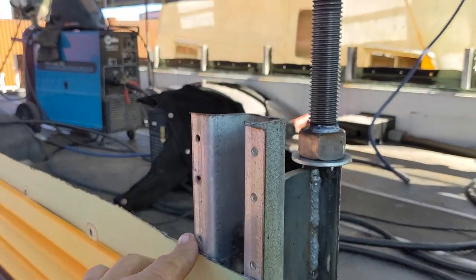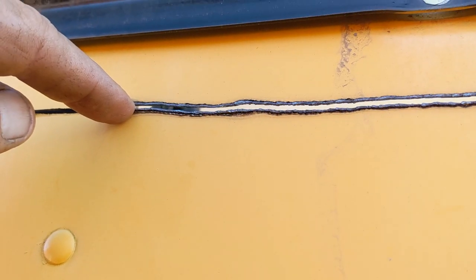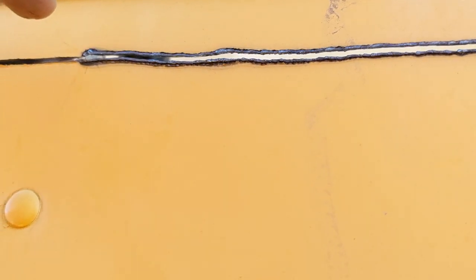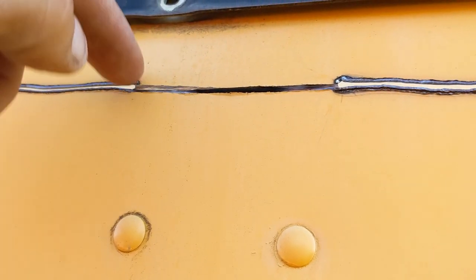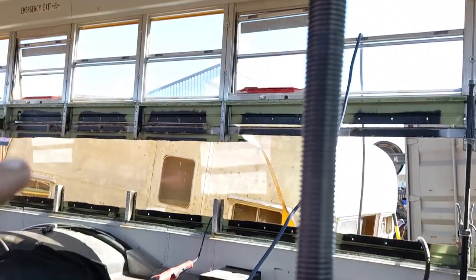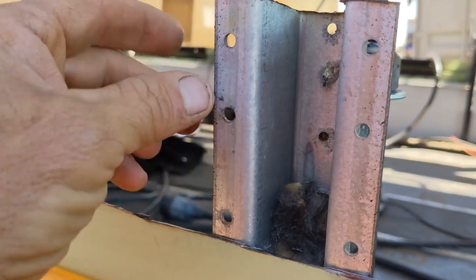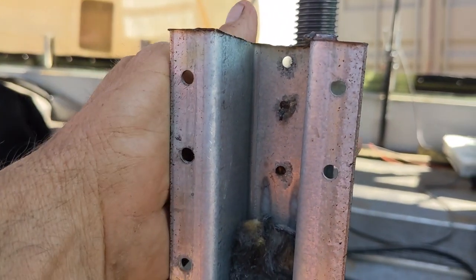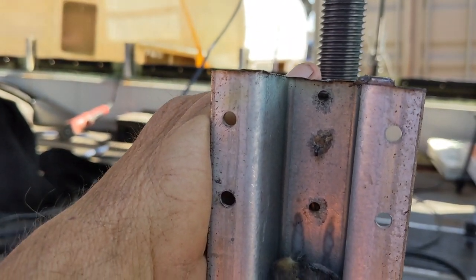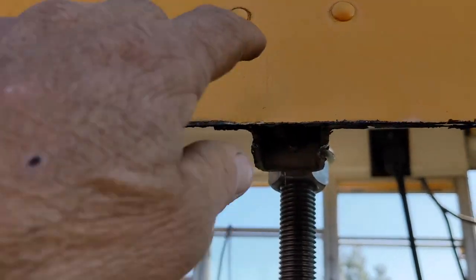So what I did is I did a secondary cut. Run across here, I did this from the inside with the plasma cutter, and then on the outside, I just went across with the zip wheel, a shallow cut. I'll grind these rivet heads off. And I did the same down here, and that's what it looks like. So now that's exposed the framing member, the rib, the hat channel,